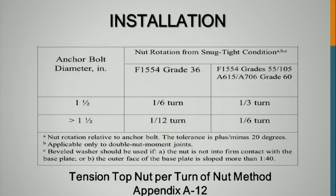For those of you that haven't seen a slugger wrench or don't know what we're talking about, the head of this wrench in here is a slugger wrench. The handle's normally about down to here, and there's a square end on it that you hit with a 10-pound sledgehammer. I cut the square end off so I could stick it in a pipe and weld it in the pipe and use it as my breaker bar. But it's got a head on it like this.